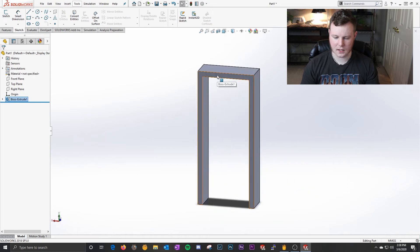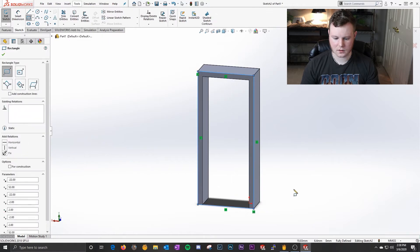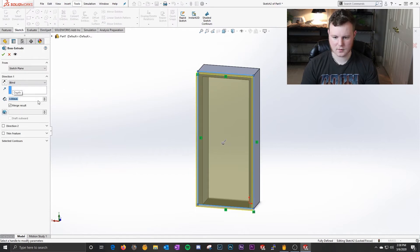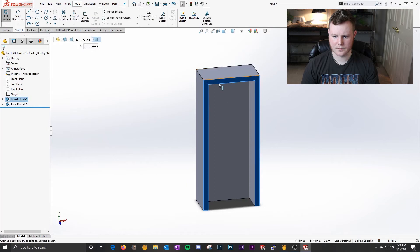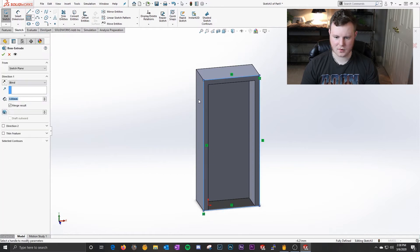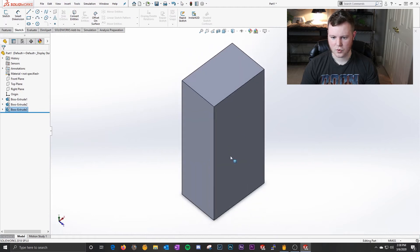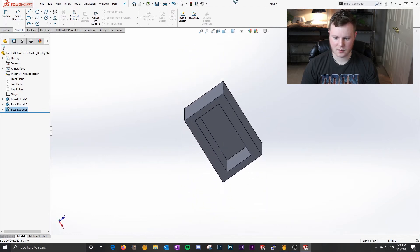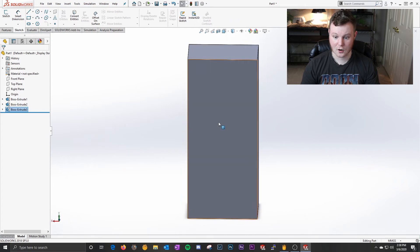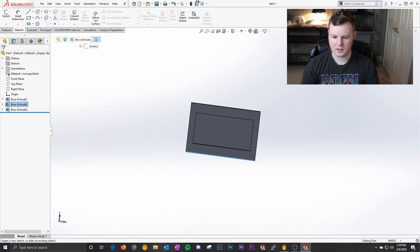We need to add a back and a front — you can do this lots of different ways. I'm going to make this three millimeters, a little thicker. I've never been formally trained in SolidWorks, so there are probably a few things experts would cringe at — sorry! So there's your box. The DHT is going to go in there, it's open to the air through the bottom, and it's closed off on top so you don't have to worry about water dripping onto it.